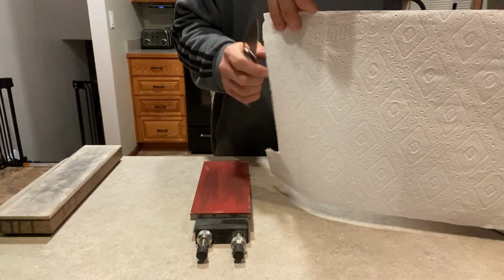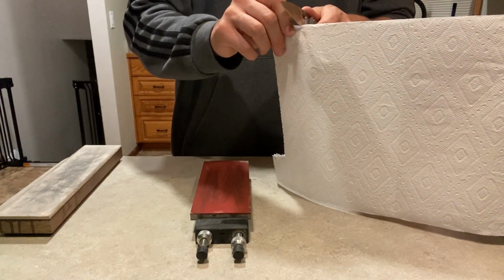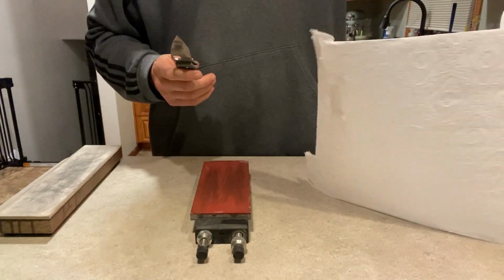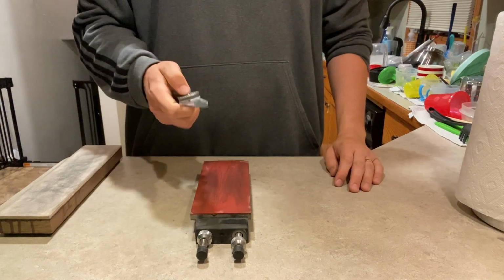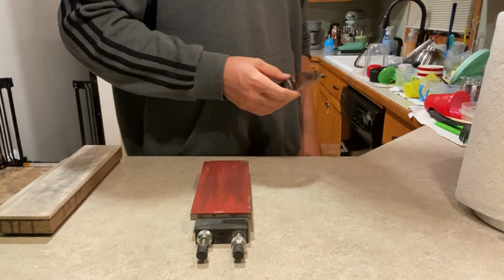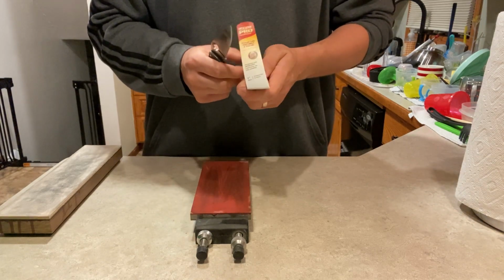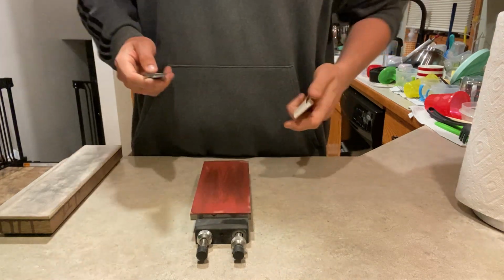Man, I mean, here, do I reverse hands on it? Here we go, I'll do this left-handed. I don't know how stupid my left hand is, so. Fuck, that's way worse. No. Nope, it's irrecoverable. So what to do at this point if you've got an edge you're not happy with? Oh, let's do the mirror. The best thing to do at this point would be to go back down to a lower grit stone, say the 400 would be a start. Maybe for Maxamet, just start over.